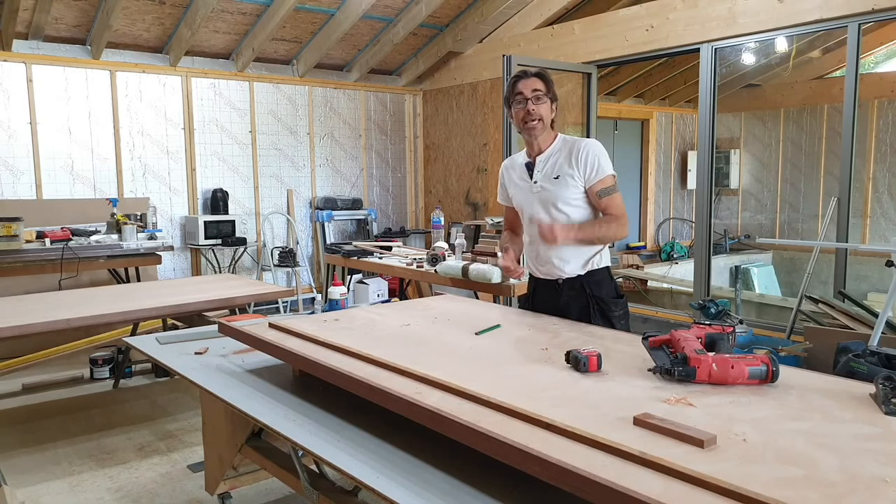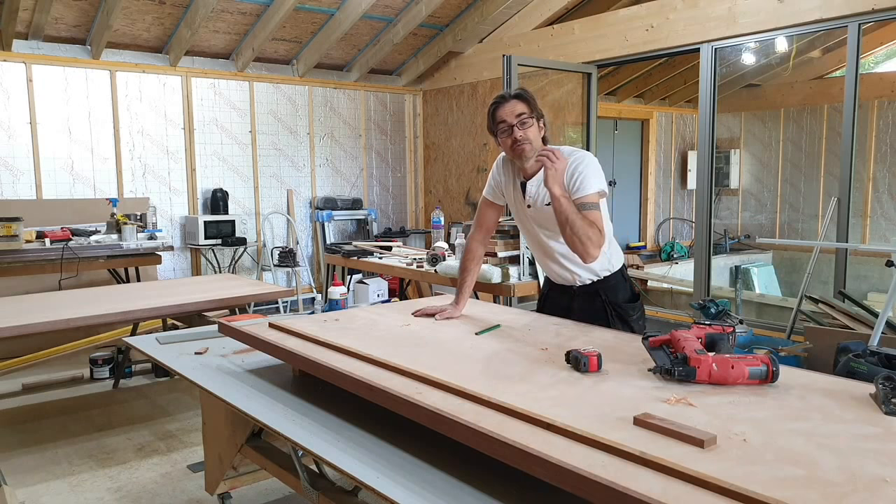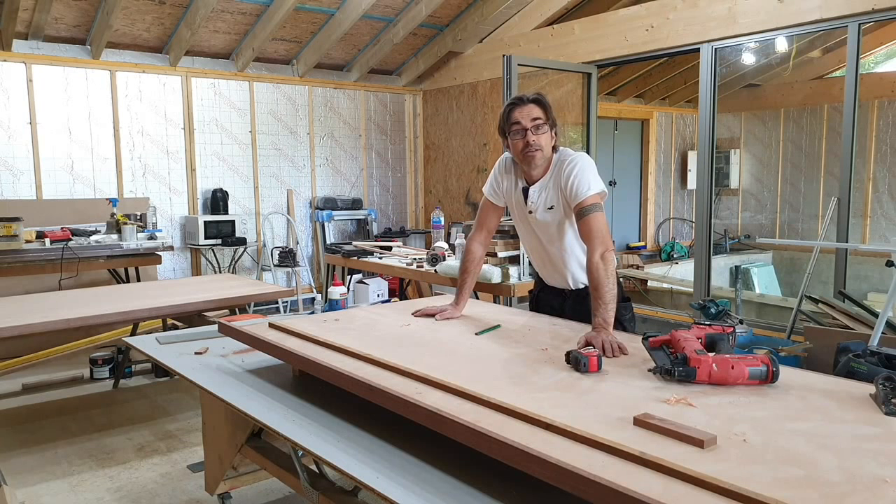Someone asked via the comments about sealing doors — yes, they will move if you've got an unsealed door and inconsistent humidity. If you have a humidity-controlled environment with consistent moisture levels and good ventilation, it'll be fine. But fresh plastered walls, decorators coming in, lots of moisture, or buildings drying out — that's fatal. Seal your work up, get it covered and protected, because otherwise you're going to go back and redo it, and that is a nightmare.